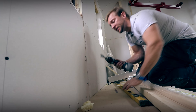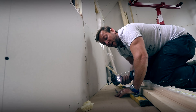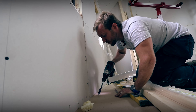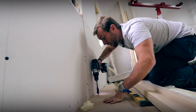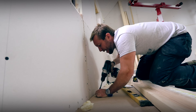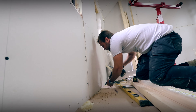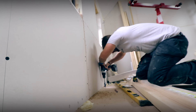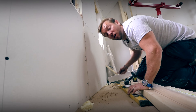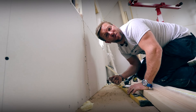The secret - get yourself a drill and don't drill a 16mm hole, give yourself more room. I've got a 20mm bit on here. Make sure before you do this that you're not going to hit any wires or anything like that - you don't want to upset the sparky, and you definitely don't want to end up dead. So let's go down through here. There's one hole. Now I'm going to drill the holes over there for our hot and cold coming up, and then pop over to the other window and drill our holes for that radiator as well.